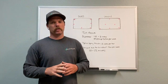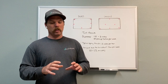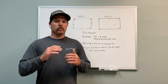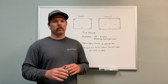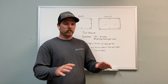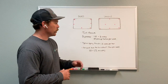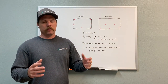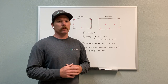Next, look at your sprinkler system and see what type of sprinklers you have and what the output is. They are measured in precipitation rate, or inches per hour. Most traditional pop-up heads — the old-school ones — put out about two inches of water per hour. We're going to assume your system is pretty well laid out and coverage is good throughout. In order to get two inches of water on the grass in a week, if your sprinkler system puts out two inches per hour, you guessed it — you have to water for 60 minutes.